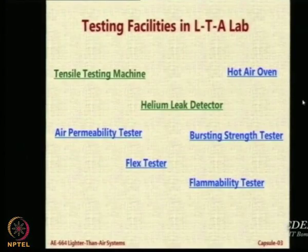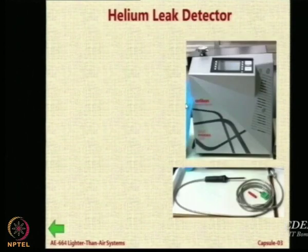The only option for that envelope is our helium leak detector, but it is very expensive — 17.5 lakh rupees for the machine alone, plus around 30,000 rupees for the trolley and 5,000 to 8,000 rupees for sniffers. It cannot be taken to remote locations easily. So it can only be used when we are desperate and want to pinpoint leaks exactly. What we normally do is mark leak-prone locations with a red colored circle and touch them up, but this method is very cumbersome for distributed leaks.